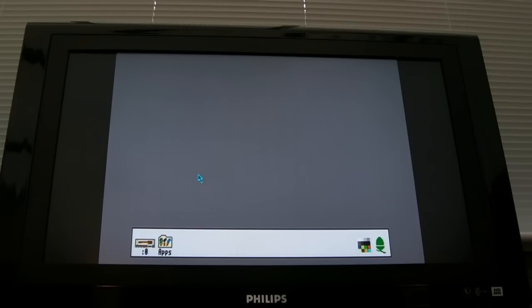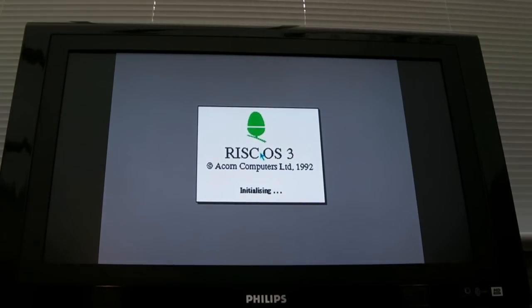I'm amazed. Now, before I got to that stage, I'll show you, I hold the delete button down. So again, I'll do that now. It came up with a supervisor prompt originally. You see that red border? That shows the delete key's been detected and it's reset the NVRAM. And then it boots. Fantastic. I'll connect a speaker up to make sure we've got sound.